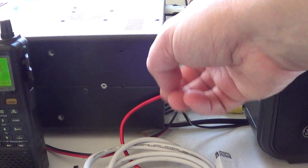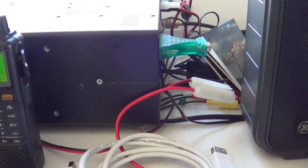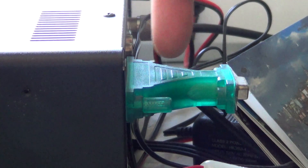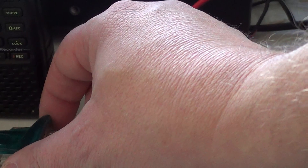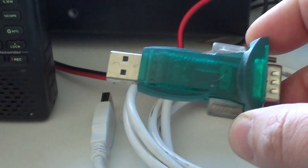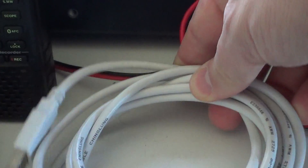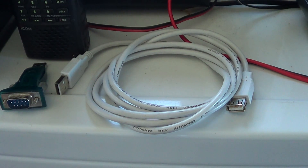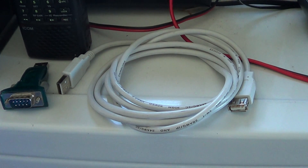I prefer using the RS232 input of the radio because it's there and it works really well. So keep in mind you might need a DB25 to DB9 adapter. If you have a laptop or a very new computer that does not have serial ports, you will need a serial to USB adapter — you can buy it online or find it at an electronics store — and of course a USB extension cable so you have enough wire to put your computer a little farther from the radio. This is the basic setup for the ICOM ICR-8500.